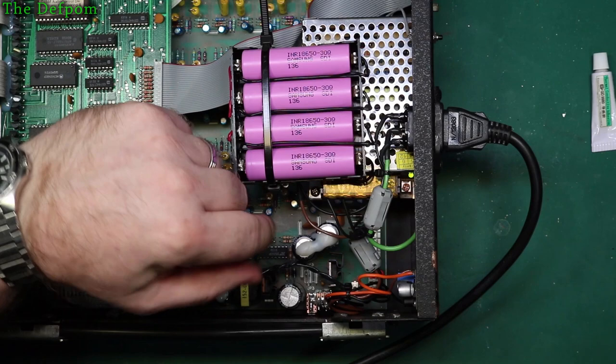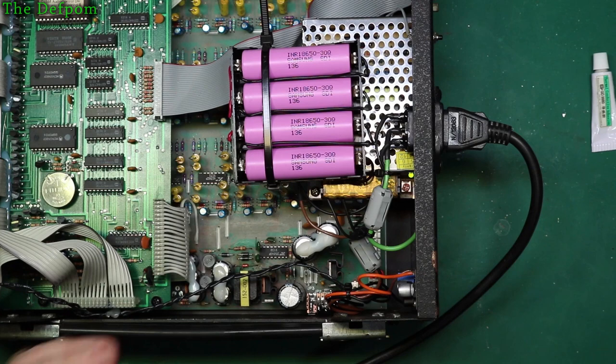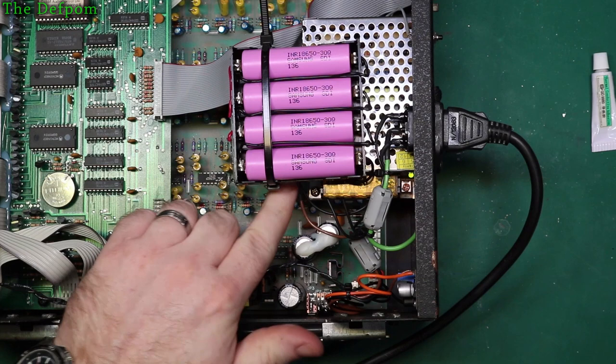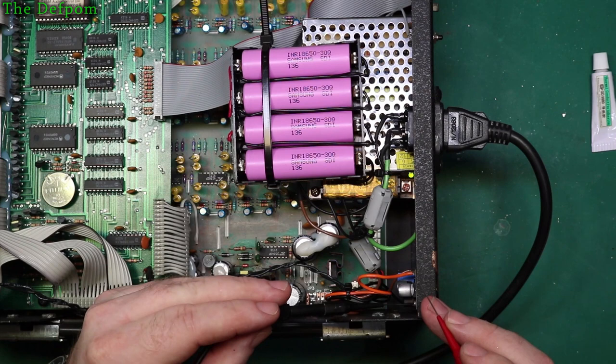This is currently running. I've got the green light running on there. You can just see the green light there, and it's working fine. So that resistor and diode combination works really well for the charge rate on this. I've increased the voltage to 17.4 volts because of the voltage drop on this resistor anyway. It will help to cushion that a little bit and take some of the harshness out of the charging circuitry. And don't forget, the original circuitry is supposed to run 18 volts. That side of it is all still well within what it's expecting.